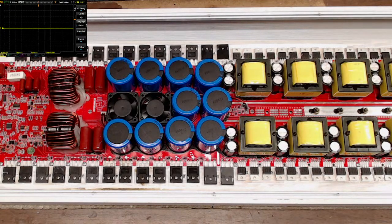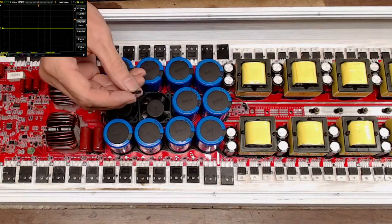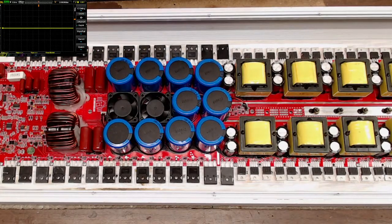Where was I? Okay, so we have determined these C5s. Again, there's a marked C5 on the board or on the chip itself. The C5s you're going to find are going to be the IRS 20957S with the input signal on pin 3. And then on this particular board, not on every board, you're going to have gate drive transistors, little 6-pin gate drive transistors. I do believe they were defaced, of course. For right now, I put in the 3005s, but I do have 3003s.